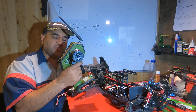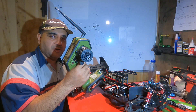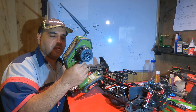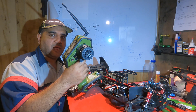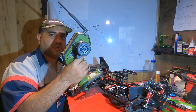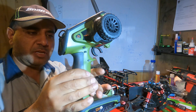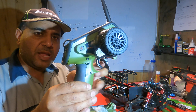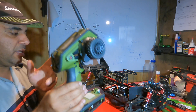It's very simple. We're gonna turn on the ESC — hold this down and turn it on slowly so the ESC can understand. All the ESC needs to know is what is fully throttle, what is fully reverse, and what is neutral. It knows in between what percentage it needs.